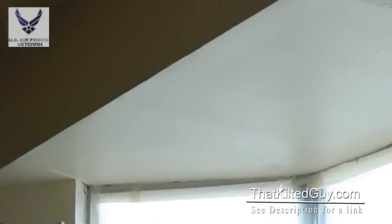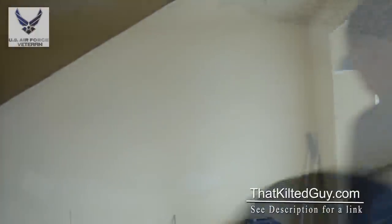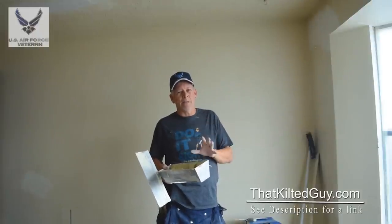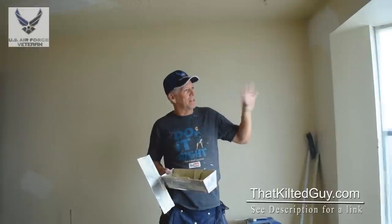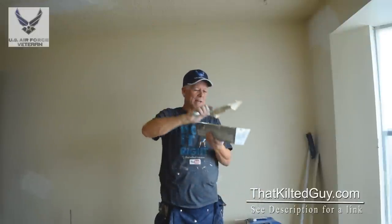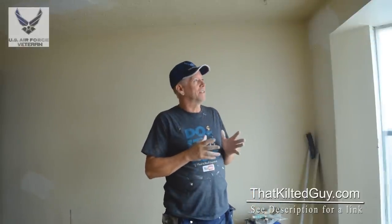You notice in the video that I quit leaving those marks and it looks pretty dang smooth — it's not as smooth as it looks, but it's pretty dang smooth. This is a lot harder than it looks; this is kind of an advanced technique. There is another way I'm going to show in a future video how to skim coat easier — it's just slower and often takes two coats of mud. With this method, I can usually make textures like that disappear in one coat of mud, because to roll on mud that's this thick is really hard. But to put it on with a knife you can put it on thicker, and thicker is going to cover more.